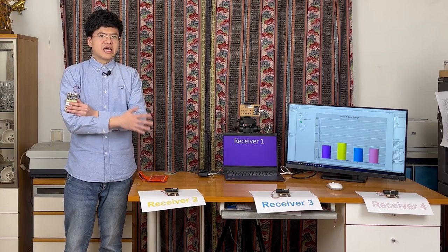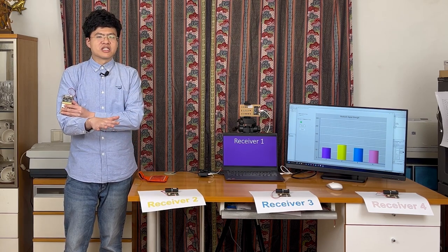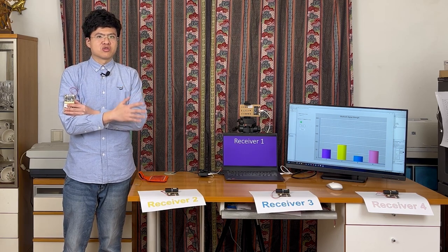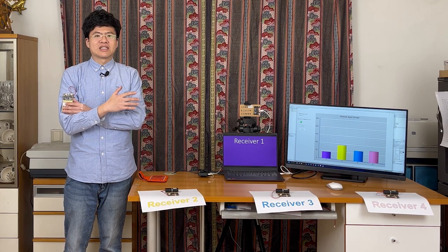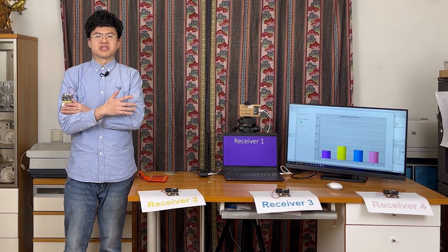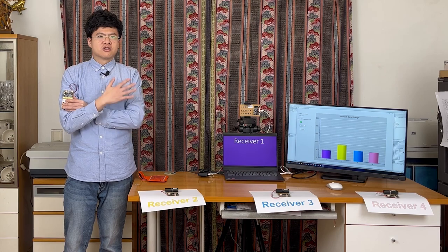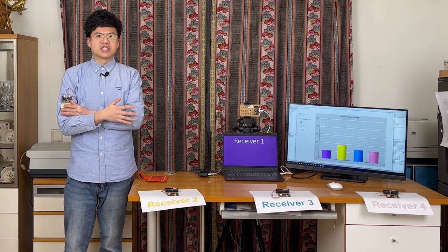Receiver 2, 3, and 4 all have antennas facing up. They are unable to receive signals from beacons at a distance, so receiver 1 is specifically used to communicate with the beacons on the players' arms at a distance, detecting if a player is moving. Under conditions without strong radio interference, receiver 1 can cover a distance up to 25 meters, so the distance from the starting line to the finish line can be up to 25 meters.